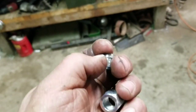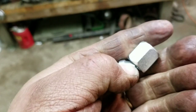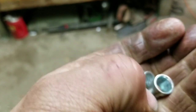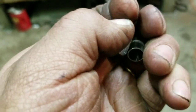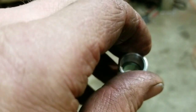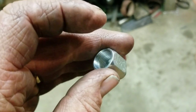They have this little sleeve. This is 3/8 tubing — the tubing fits inside the sleeve, the flare goes right up against that taper, and that backs up the flare so it doesn't crack. The little sleeve keeps the tubing from cracking. I'm gonna flare these and I'll bring you back.